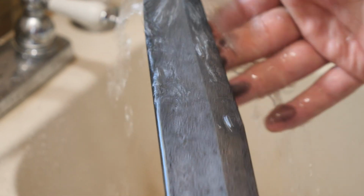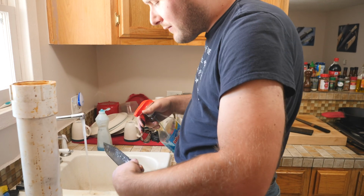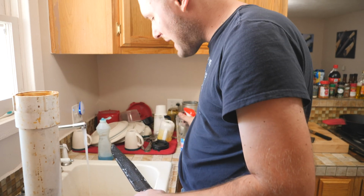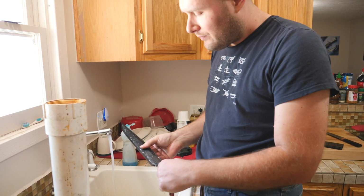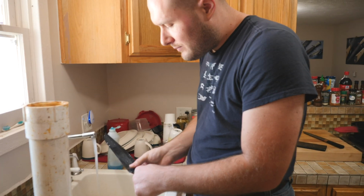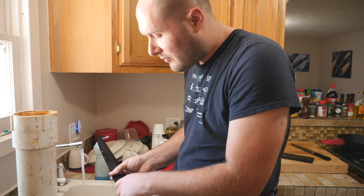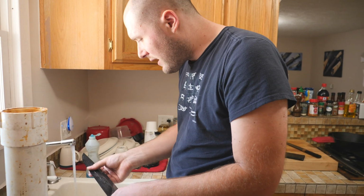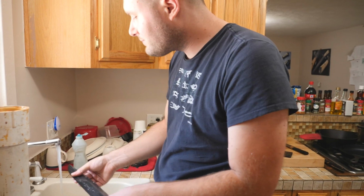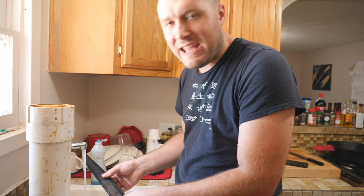Coffee darkened up. I'm neutralizing the blade because it's got all that fresh ferric chloride on there. And that ferric chloride could keep etching on one side of the blade while I'm sanding on the other side. And I don't want it to do that. So neutralizing kills the acid, so it'll stop etching. Ammonia does it, or also trisodium phosphate works well. A bunch of baking soda mixed in with water does it really well. I have a tank with that out there.